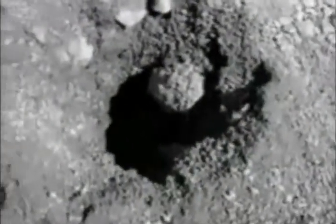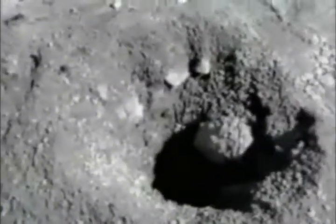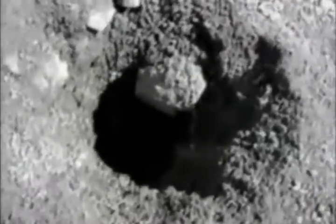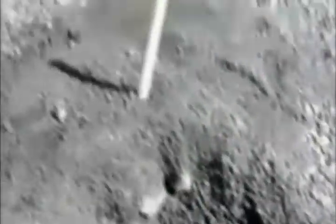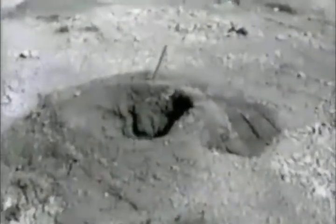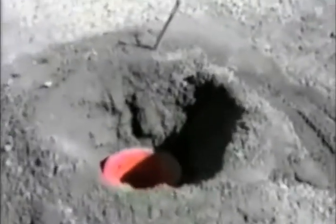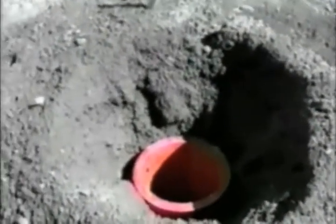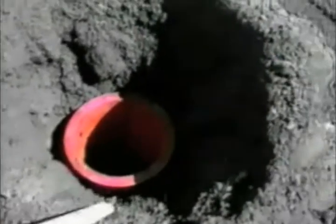This is a fairly typical hole collar — you can see it's rough, actually pretty dry, very friable, with ability to slough in. These holes are all wet; you can't see the water but there's water in all of these at about ten or sixteen feet somewhere in there. As you go along, you can see the washing effect of baling the water with the cuttings done here, and these hole plugs are three or four feet deep into these holes.